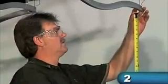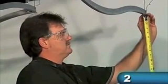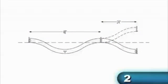In the event that a main tee is hung 2 feet from an adjacent main tee, it will need to be hung at a higher or lower elevation. Refer to your 3D drawing to confirm the proper height. Tightly wrap the ends of all hanger wires to prevent them from being seen from the side after installation is complete.